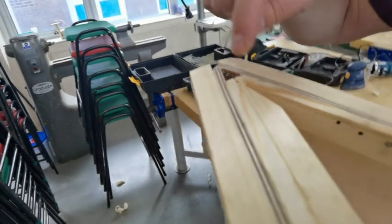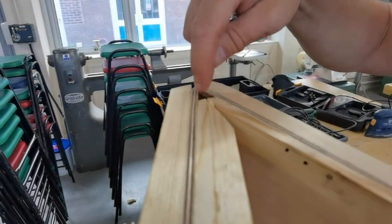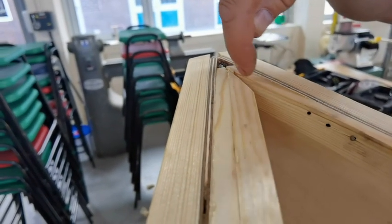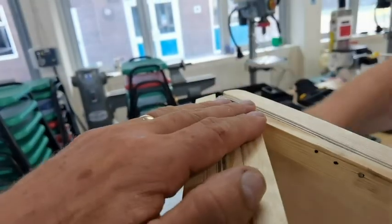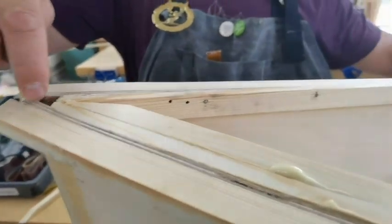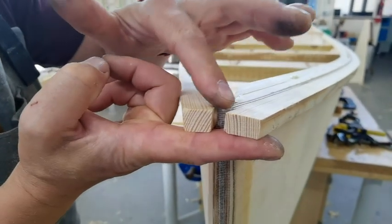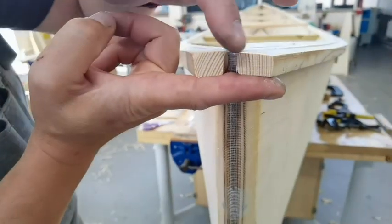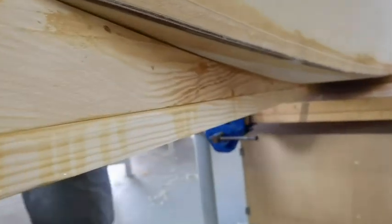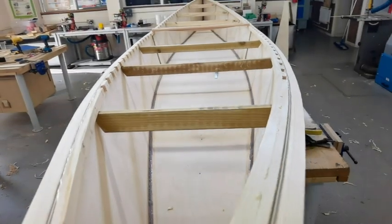What are you going to do at the end here? Well, this epoxy puddle here which is brown is beautifully triangular shaped. So what I'm going to do is make a bit of a feature of some of this here - I'll make a mahogany infill piece. I'll cut a slot in here, fill that with a brown adhesive again - so we'll see triangle, thin line, triangle, and another bit there. I'll make a feature out of what was a mistake. It's just a personal touch that came about because of this void. I thought if I fill it with epoxy and polish it, it'll look like a little brown triangle. I'll filter the epoxy into that little gap there and then that'll just be tidied up and rounded on the end. The keel went on beautifully Mark - rock solid. I've filled this in here with the wood dust and epoxy there and that'll all get tidied up. So I've gone from cutting bits of wood out to sticking bits of wood together, back to cutting bits of wood away again.